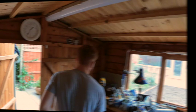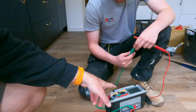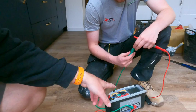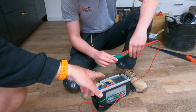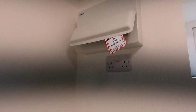Jack's all done down the other end so now we're coming on to testing. I'm going to get Jack to do absolutely everything — I'm going to do nothing and sit over there in my comfy chair. So what we're going to do now is get Jack to null the leads — turn that to ohms. That takes out the resistance of those leads.